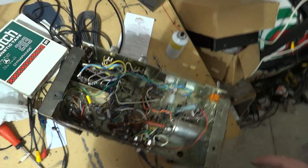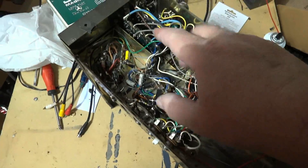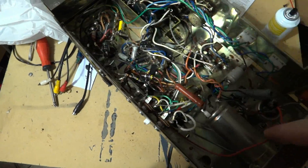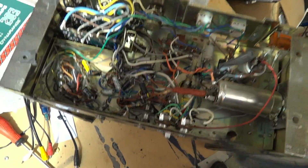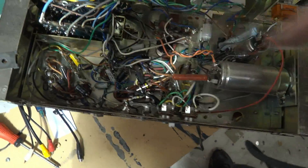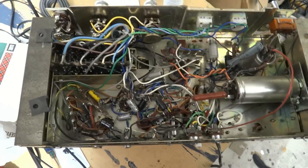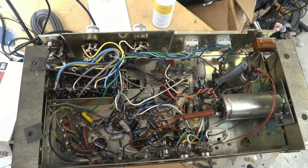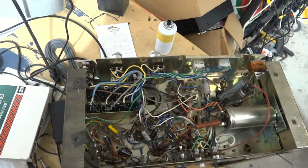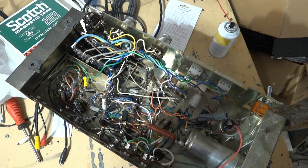As you can see, the amplifier design here is all point-to-point — there are no circuit boards in here other than small boards for mounting the switches. Everything else is point-to-point wiring. I'm intentionally not sticking my fingers in here because I've had it energized and I'm sure some of these capacitors still have quite a kick in them. Tube equipment typically runs at three, four, maybe five hundred volts and tends to hold its charge for a while — I really don't feel like finding out the hard way right now.